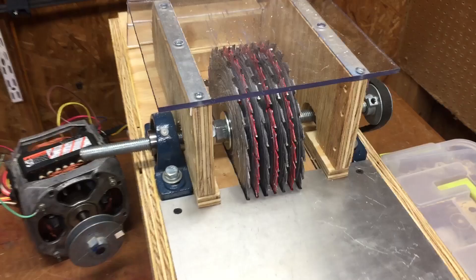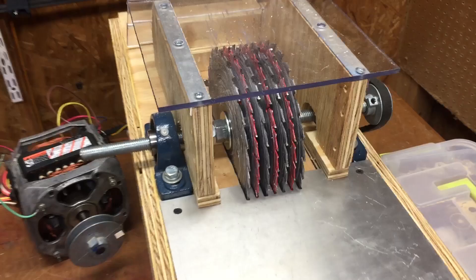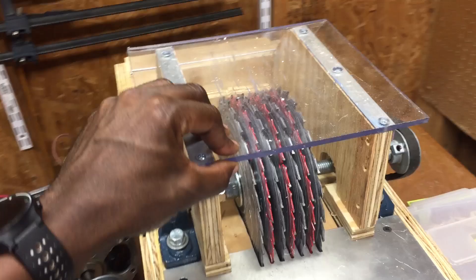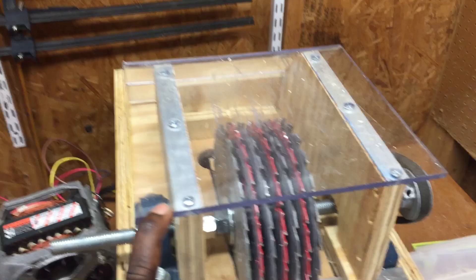Number two, I do plan to mitigate that problem by putting a hopper here in the front. So I'm going to extend this shape out this way. It'll have more Lexan on top. Lexan is a very tough, shatter-resistant material — this is not plexiglass, which would not be ideal for this application. Many machine shops use Lexan to guard their equipment because it's shatter-resistant and tough. It looks like plexiglass, but it's not.